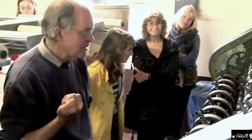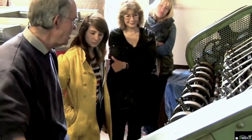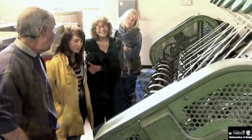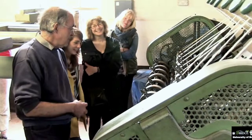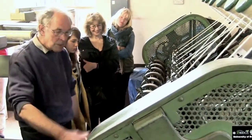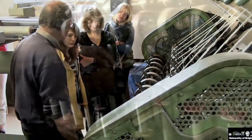Divide the number of teeth on the wheel we want, which is 18 in this case, on this machine set. 18 into 95 gives us the twist, which is 5.27 turns to the inch. If you start trying to put more than that in, it could go crinkly and kinky on you. If you don't put enough, it's not strong enough, won't pull the bobbin round, keeps breaking.